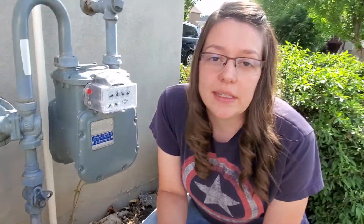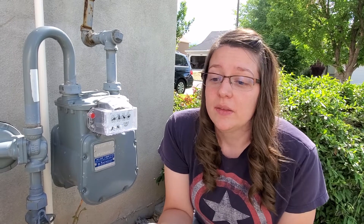A couple of safety tips you'll need to be aware of. Number one: if you have a disaster where it's also at night and you've lost power, you can't see, and you smell gas — before you evacuate, do not light any matches, don't light any candles, and don't even use flashlights, because just clicking the button to turn on your flashlight can ignite a spark if there's enough gas inside your home. The best thing you can do is use the flashlight app on your cell phone if it's available.